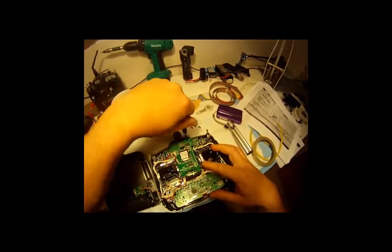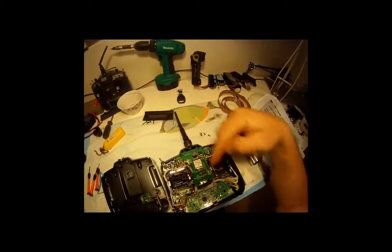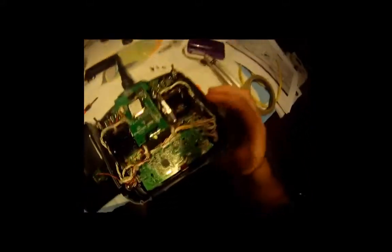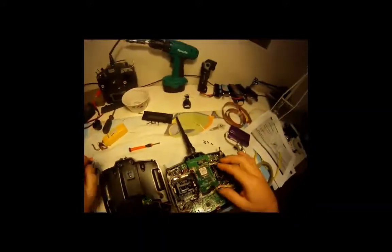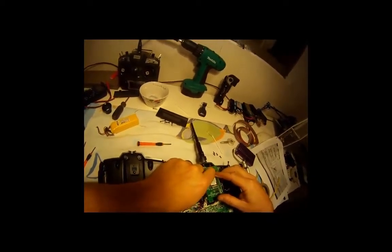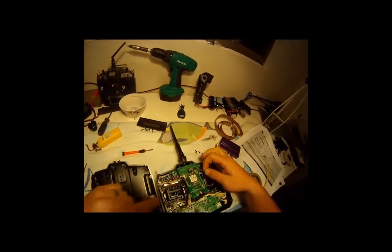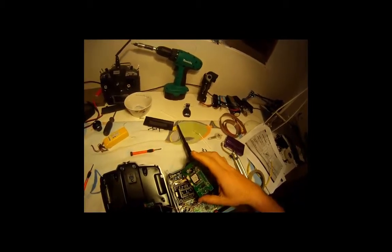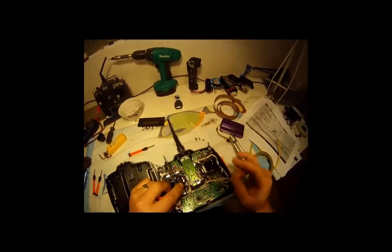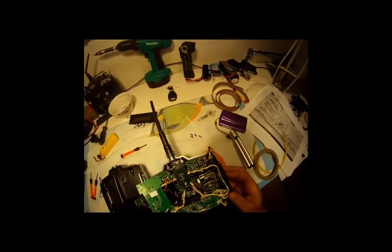This little receiver wire for the actual receiver itself — the wireless aerial wire — is just here. I'm going to flick that off because I've got to take this board aside. Carefully flip that off like so. We'll make sure we put that back on again and carefully roll this board over. Be very careful of that wire because it's a coax — a miniature coaxial wire, which means it's got an inside and an outside set of wiring.